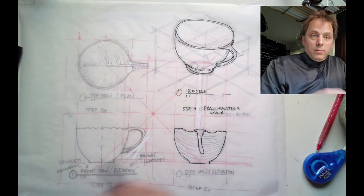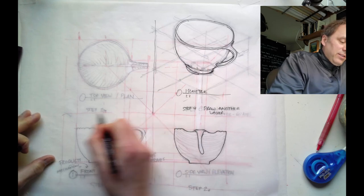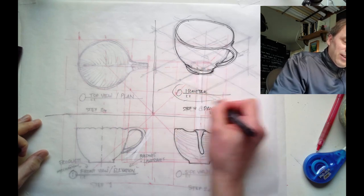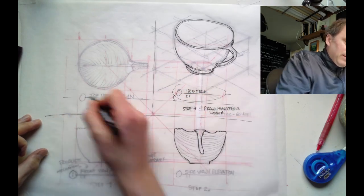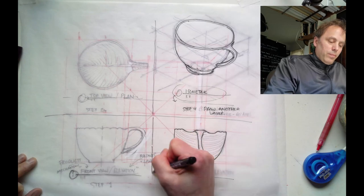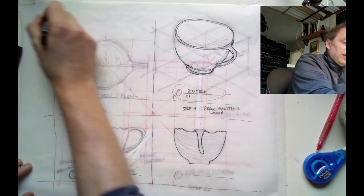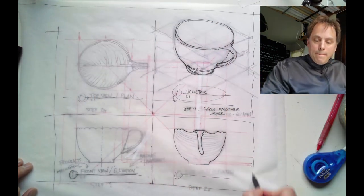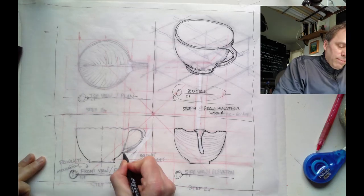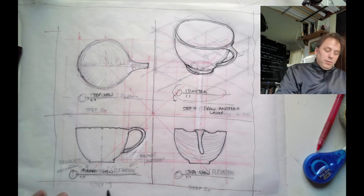So that's all there is to it. Step 1, 2, 3, 4. You're going to end up with a very nice set of drawings. Ideally, your titles would align, so this here should go down so it's on here. Title. If you'd like, you can bring these boxes all the way through. I guess you'll want to bring them here. And ultimately, that's going to be your multi-view orthographic drawing. And that's your complete multi-view orthographic.